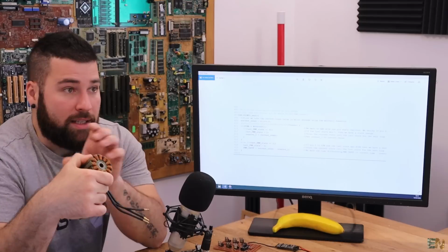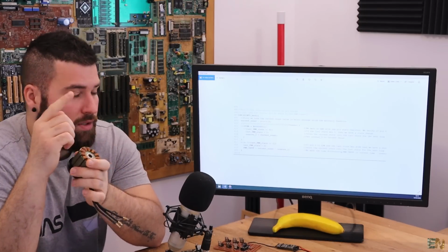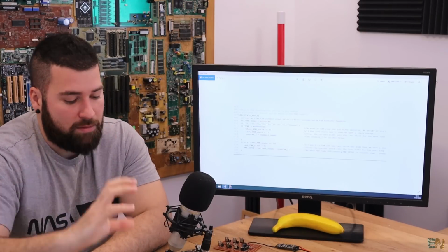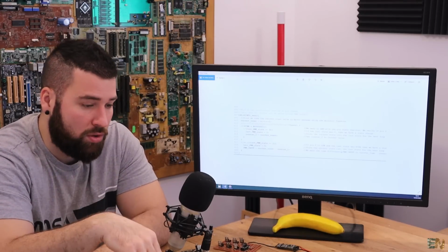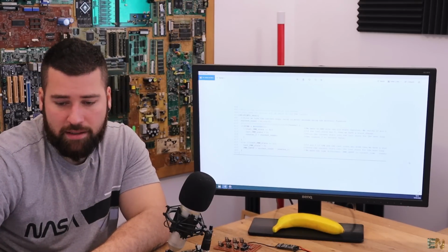And those will represent the time that you will enable each of the steps of that sequence, of the 6 steps of the sequence. So of course, the bigger the time, the more time each step will take, so the motor will spin slower. The smaller the time of these pulses, the faster the motor will spin. I hope this makes sense.